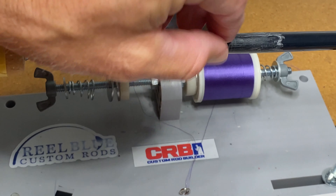And then that's really it. I'm just going to come back with some really fine sandpaper — some 220, very flexible — and then I'm just going to start to sand this down and get a nice smooth finish. We'll be right back.